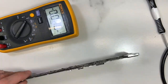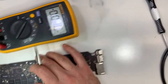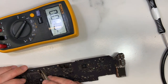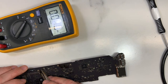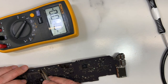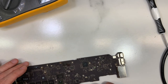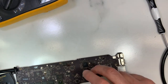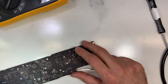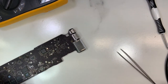The problem is in this area near the CPU — no longer the BIOS. I looked very carefully under the microscope and I saw there is a broken trace between two components: a capacitor that is burned. There was also a very critical broken trace. What I need to do now is jump a wire to reconnect the broken trace, and then we'll try it again. I need the microscope because it's so tiny. You should be able to see — I'm just going to jump the wire.